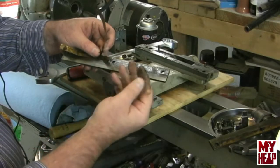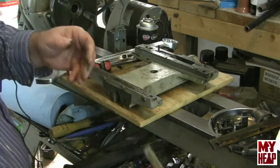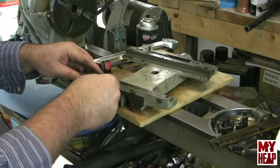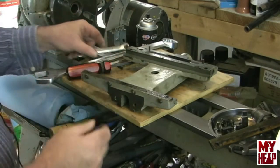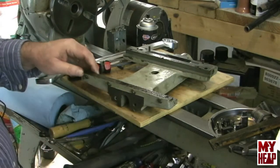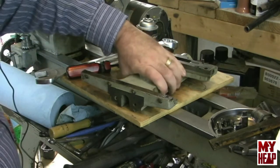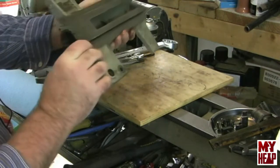The back way does look like it has a slightly wider shim piece than the other one. But there's just all kinds of gritty gunk in here, so this needs a good thorough cleaning. I'll need to get a small wrench to pull the gib adjusting screws out, but that's pretty much the entire casting stripped down and taken apart. Not a whole lot to it.